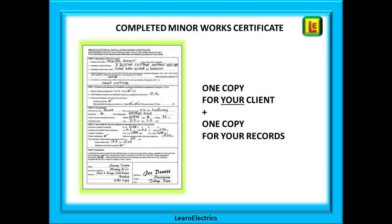Now that you have completed the minor works certificate, what do you do with it? Some certificate packs come with carbonless paper copies, which makes life easy. Other certificates do not, and you will need to photocopy and sign a second copy, or write out a second one if a copier is not available. Some electricians use computer software to complete these certificates — whichever method works for you is fine. One copy is for your customer, whoever is paying you for the work, and they should keep it for the life of the installation. If it is rented property, there is no legal obligation to give a copy to the sitting tenant — they are not your customer. The second copy is for your files and must be retained by you for at least three years.